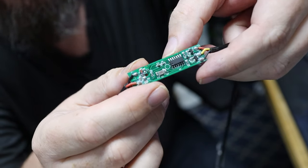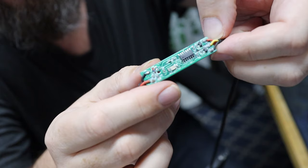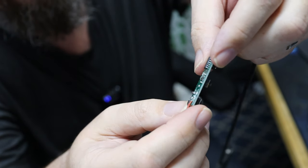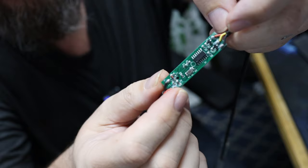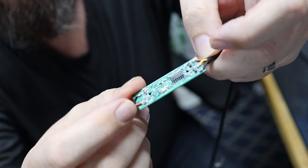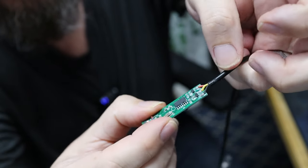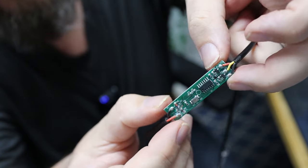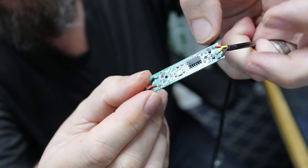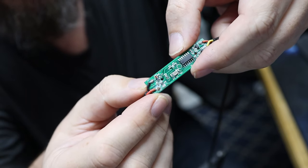So I'm just going to give everything a right good clean with isopropyl alcohol and a cotton bud, and hopefully that should be it. The kind of nirvana moment you find here is when you open up something like this — whether it's at this end or the light end itself — and a wire is not attached properly. Just give everything a little nudge; everything should be fairly secure and held in nicely. If not, you might need to get the soldering iron out and reattach it, but that's a fairly easy job. Give everything a good clean and that should sort us out.